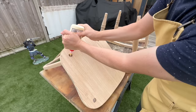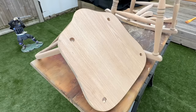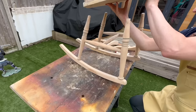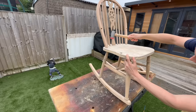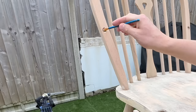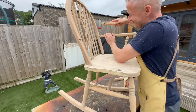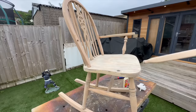Finally it was time to put it together. I used regular interior wood glue - I'm not going to keep this chair outside, so I think this is exactly the same glue that was used originally. Because the fit was super tight I just used my rubber mallet and didn't need to clamp it. I did exactly the same thing to the armrests - used my little brush and some glue, it was a bit fiddly and I was very careful not to break anything. The fit was super tight so I didn't feel like I needed to clamp them either.